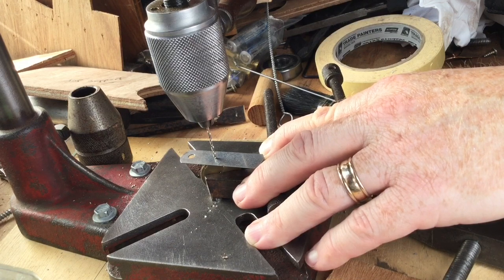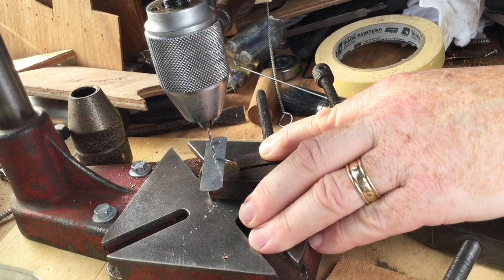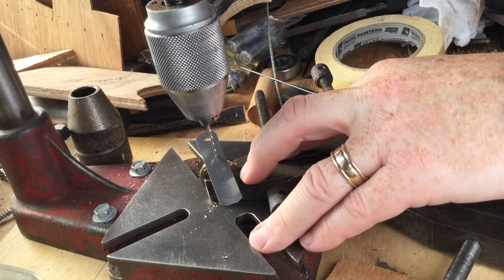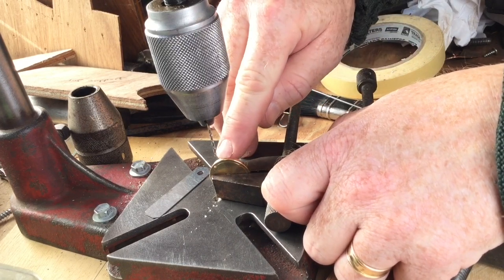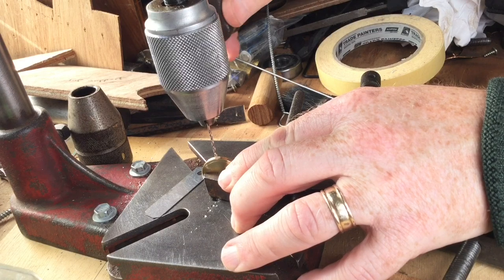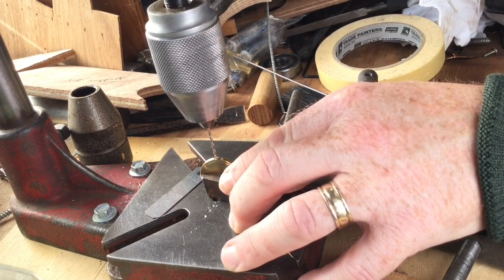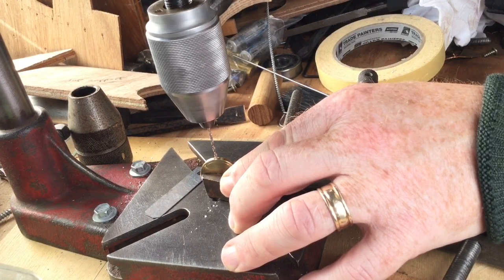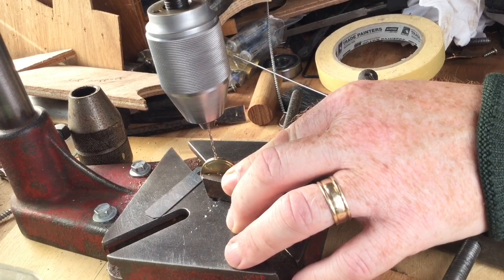If, with pressure, the leaf stays perfectly horizontal, then you are over the apex and will drill toward the center of the work. I was trying this with a fine drill bit and realized later that a center point turned up in the lathe from sturdy wire would give a much steadier result. So in this case I eyeballed the center punch mark on the work and went from there. The 1.5mm drill bit is at the fine limit for this hand-cranked drill press due to the pressure of the automatic quill feed.